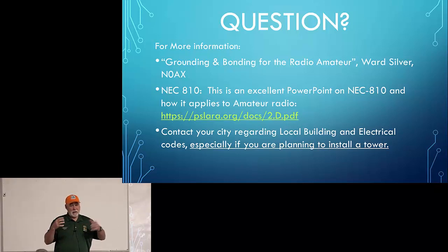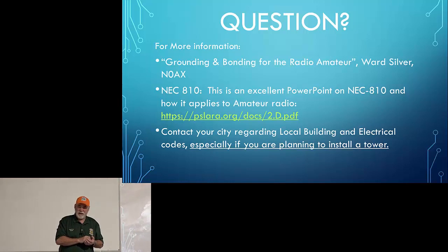And in my article, I kind of put that in context, because the loss we look at in there comes out to be like 0.78 dB. And I remind everybody that it takes 6 dB to move the S meter one unit. So 0.78 dB, is that really something to be concerned about? Now, UHF, yeah, maybe it is. But 40 meters, probably not much to worry about. Even at 10 meters, it may not be much to worry about.